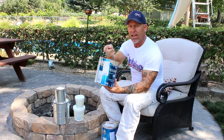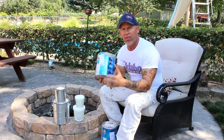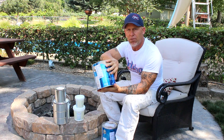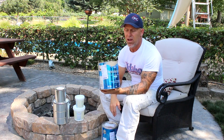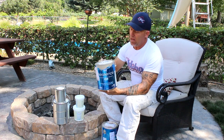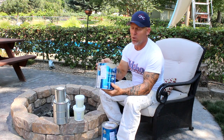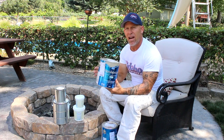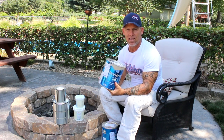Now we'll talk about labeling your products so when you store them and go back to get them, you know exactly what's in the can. For a can like this, if you're storing it in the original can, everything's right on it — except if you get paint all over the can, it may cover some important information you'll want to know down the road, say four months or four years later when you want more of that paint. If key information is covered up and you take it to the paint store, they may not be able to mix up the exact same product. So you want to write on the top and sides of the can where there's no paint.